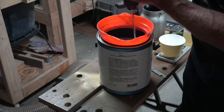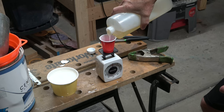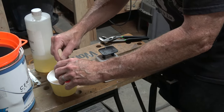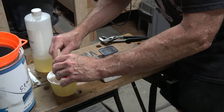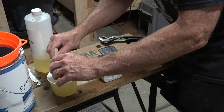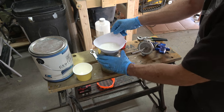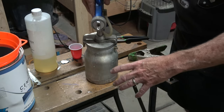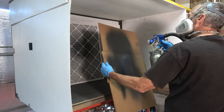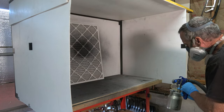The clear coat I'm using is Centurion's water-based 2K polyurethane in a matte sheen. The first thing I have to do is thoroughly stir up the main component — the polyurethane with matte sheen — and then carefully mix in the hardener at about a 10% ratio. I slowly pour the hardener into the polyurethane while stirring so it won't clump up, which can happen when mixing two-part polyurethane products. Once done, I filter it into my spray gun. These 2K polyurethane products, especially Centurion, can be really thick once mixed, so I have to use the largest needle and nozzle combination — in this case 2 millimeters.